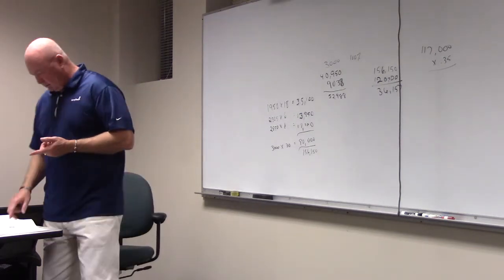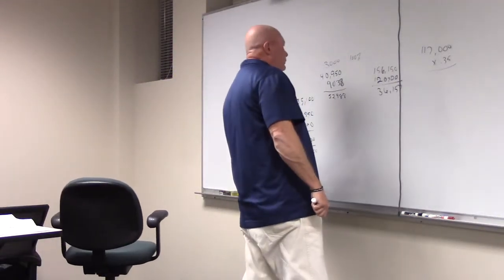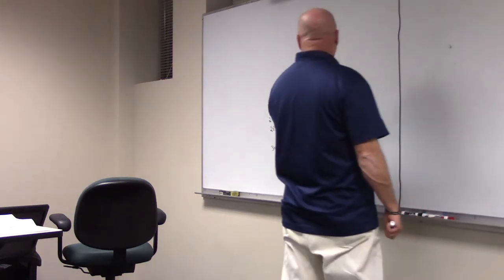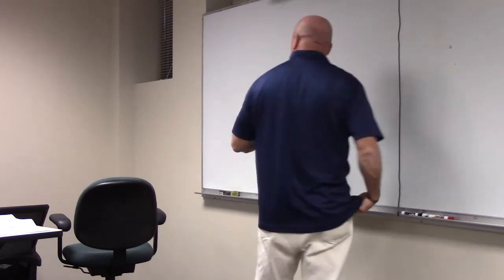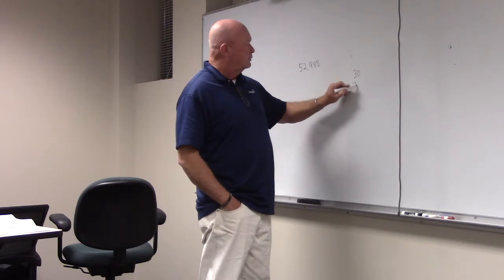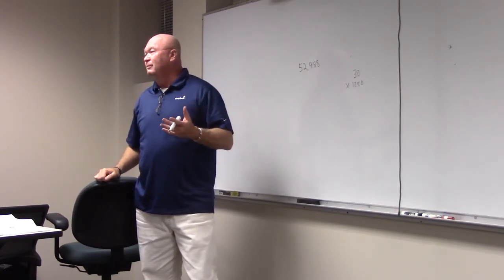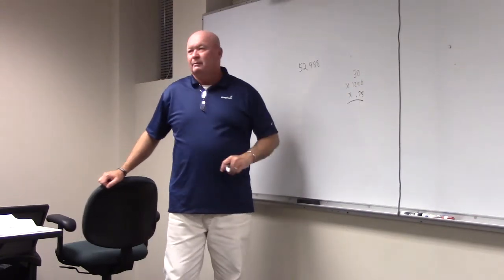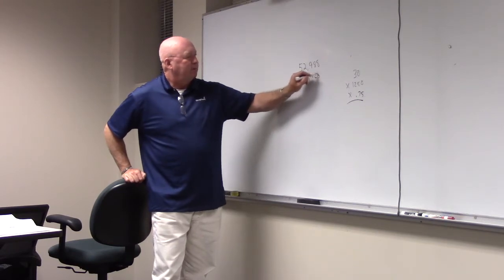Now it says we've got to do the appliances. The dishwasher, there's 30 times how many? 1,250. Let's erase some of this. The only thing we need to know right now is this number right here, 52,988. Let's write that down. How many dishwashers do we got? 30. How many volt-amps were they apiece? 1,250. And why does it say there in the book to do that times 0.75? You got more than four. If you got 30, that's definitely more than four. So we do this and then times 0.75, and what it says in the book is how much? 28,125.